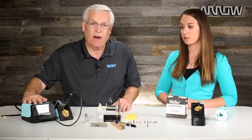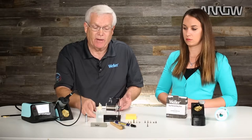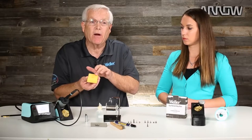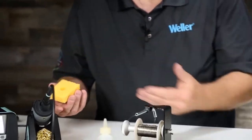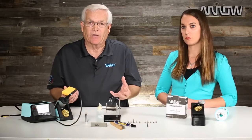These are techniques to maintain that soldering tip. Soldering tip life is generally not just one thing — it's a combination of the temperature you're using, tap water with contaminants, somebody using the wrong sponge, or not cleaning the sponge as they use it. Fluxes get caked up and as you wipe the soldering tip on a dirty sponge, that material gets onto the tip — and then you've got high temperature, aggressive flux, and all those things in combination oxidizing the soldering tip.